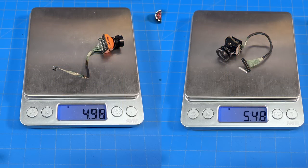The next major area is the two cameras currently available: the RunCam on the left and the Foxeer on the right. There's a full half-gram difference between those two cameras. Many people have had difficulties with the Foxeer DigiSight cameras — focus or just getting them running. I have two of them. One did die, but I'm not too surprised since I've been flying these a lot and crash all the time inside the house. The camera just stopped powering up rather than taking lens damage. I also damaged a MIPI cable — one of the wires got pinched and severed. So if you want the lightest, you obviously want to go with the RunCam right now.